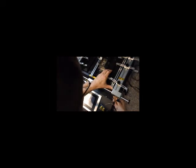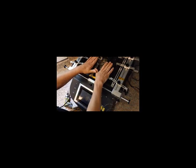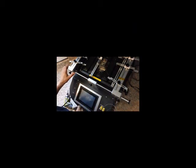The lower probe in the lower airstream is not really affected, so that doesn't really get touched very much. I kind of bent that a little long there, but really the best way to do it would be to pull the length back. Once you have it clamped in there, pull the length back so it's right there, and then make some bends and actually have it laying right there so it's straight into the airstream rather than coiled all up in there, so you're getting a good reading. So your tip's shooting right into the airstream, it's below the board, and your other probe is handy, so next board you get, you just bring it in and do it all over again. So that's how we set up the probes on the system.